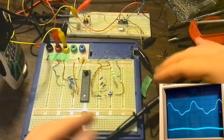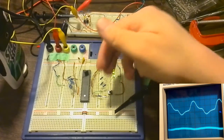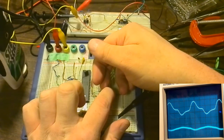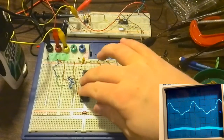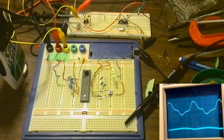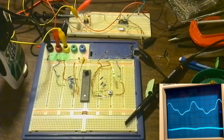This is why we don't build microprocessor systems on a breadboard — it is very erratic and error prone. But as you can see, these are the three LEDs, so if I release it from reset it will start counting. You might see the top one flickering a bit. But this is showing me that this Z80 is actually running off the clock, which I already knew because I pulled it off this other board.